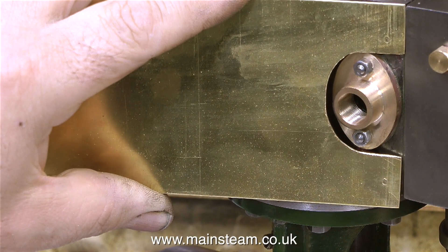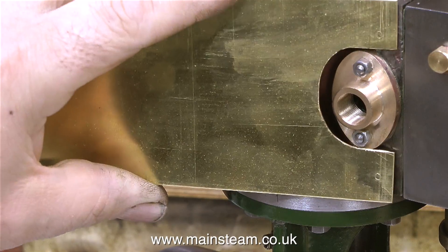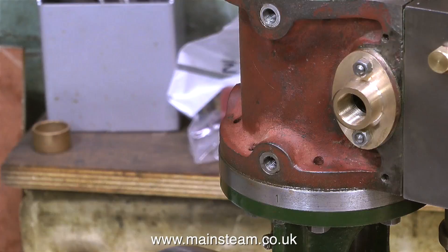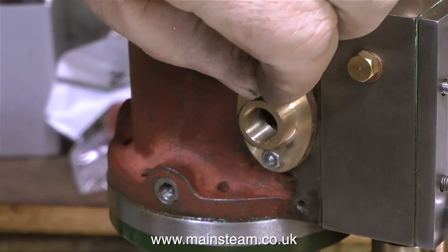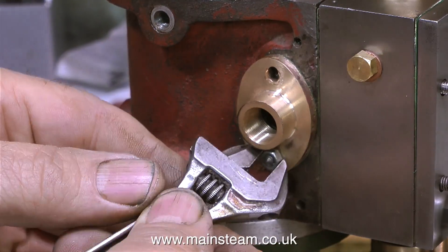The first operation is a success — the cutout looks good. It's a much better shape than on the previous piece of cladding, but it doesn't fit around the exhaust manifold. That's easily rectified; it's because the exhaust manifold is the wrong shape. So I'm going to remove the exhaust manifold, re-trim it to the correct shape, and re-fit it.